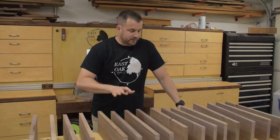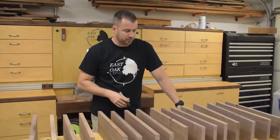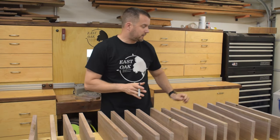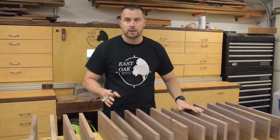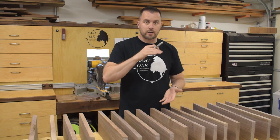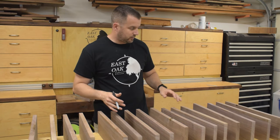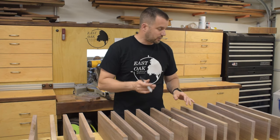These have sat now and they really haven't had any movement at all, so I'm going to mill them down to their final dimensions. Before I do that, I'm going to mark them all so I can keep them in order. I cut them in a specific way, keeping certain boards together for certain pieces. I've got to glue these up into panels to make the two sides, top, and bottom of that lower case - keeping them matched so I've got the best grain in the right places.